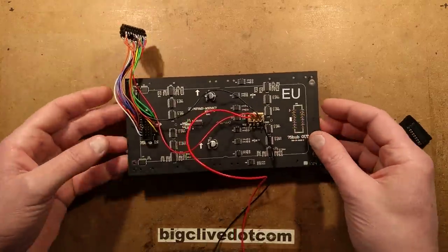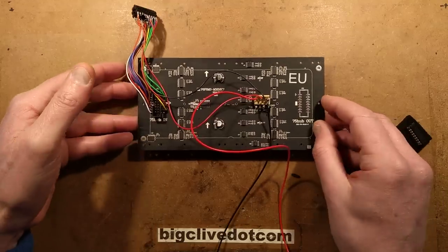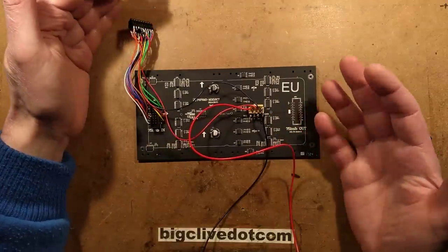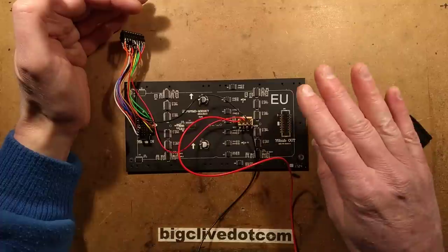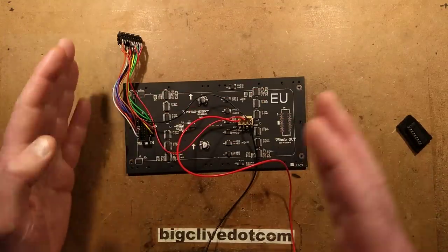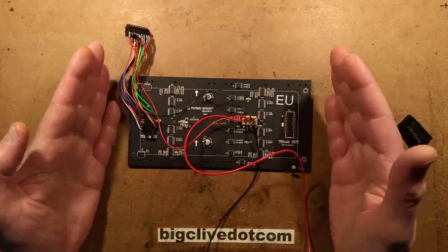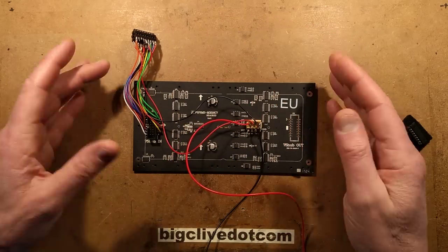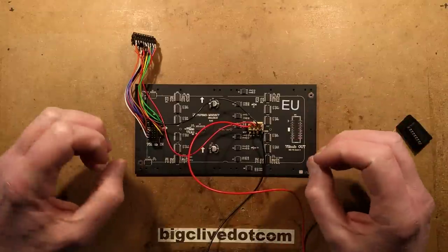The display is divided into two sections: the top eight lines and the bottom eight lines, which is why there are always two lines lit at once. When you send data in, you clock it in - you present red, green and blue for the top half and red, green and blue for the bottom half as a simple on/off. There's no intensity control. You fill it with 32 sets of RGB data, then trigger the latch which latches that in and displays it.